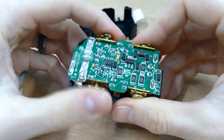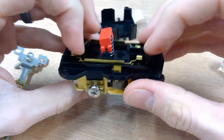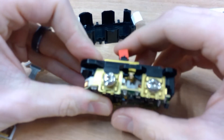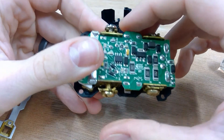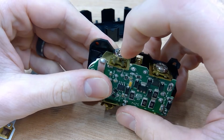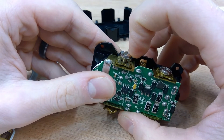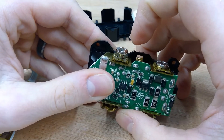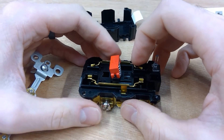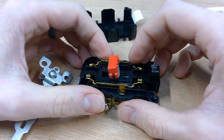So it's a complicated but really fascinating way to ensure that we supply power to the circuitry, but we can discontinue power both to the outlet itself and to all the outlets downstream if something happens — in this case a difference in current between what's coming into the circuit going off to our device and what's coming back through the neutral. The only other alternative is that electricity found an extra path somewhere else to ground, which is probably through water. That's why it's a requirement to install those anywhere where there's water sources nearby, and also recommended to use GFI outlets anytime you're working outside. Sometimes a nice extension cord will have a GFI breaker attached inline.